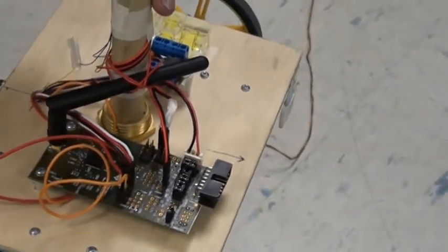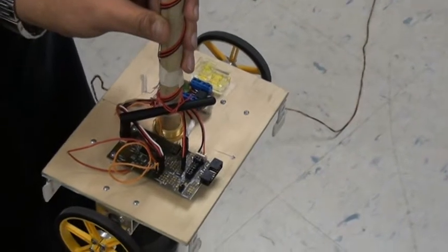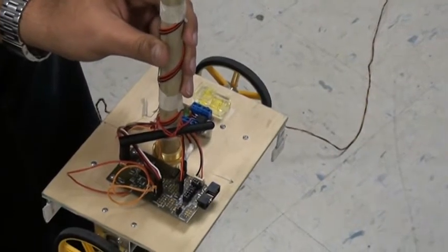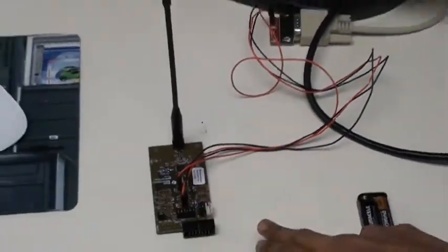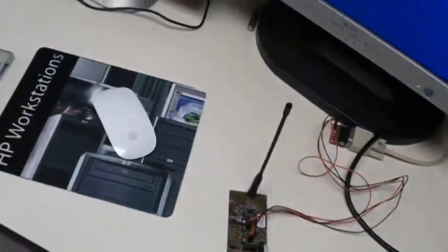So what kind of protocol is used over wireless? It's 915 megahertz wireless data communication, transmitting at 175 kbps. On the interface side, it's a standard UART — so it is serial. Here is the same replica of the wireless module. It receives the data and sends it via serial cable into the target. So there's an RF link between the two.